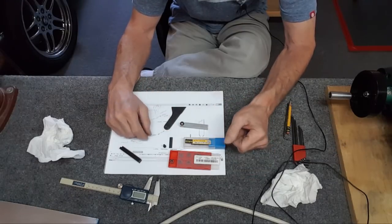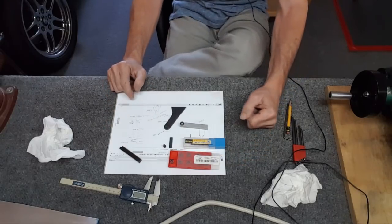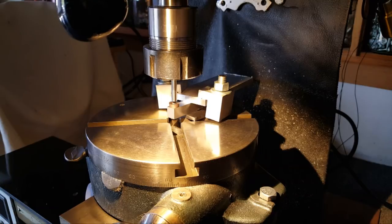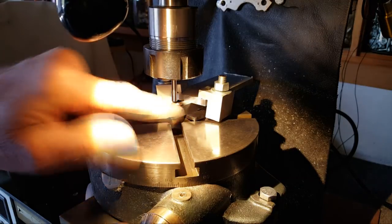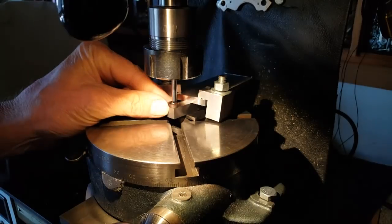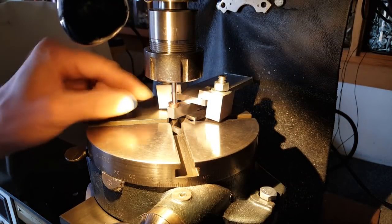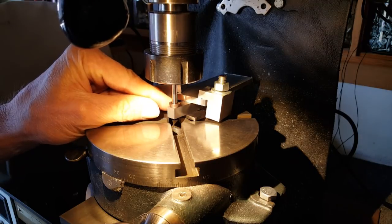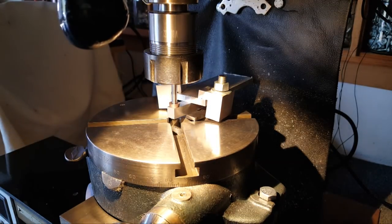So I guess it's set up on the rotary table for a 175 radius. Well, this one's always fun to do. Set up for rounding it. First time I set it up like an idiot, I completely forgot to put a spacer underneath so the end mill doesn't go into the table. Grab a gauge pin that just kind of will center it up. Yeah, you can see it just now shifted, so I know where it's at.